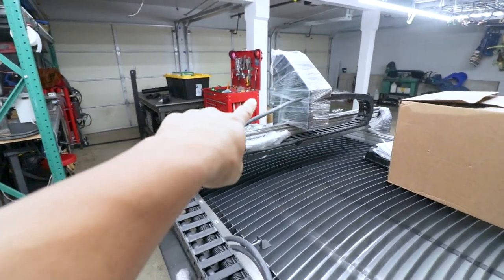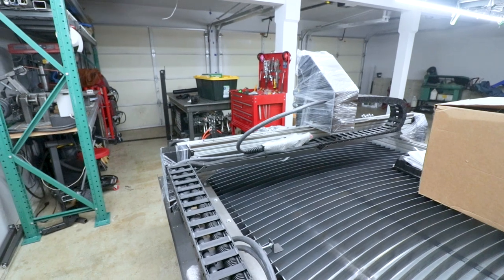I just wanted to show you how that system works, and hopefully it all makes sense and you can see why I plumbed the copper pipe the way I did. I'm using half-inch pipe for all my plumbing here because I'm only running a short distance in this 500 square foot shop. If I was running a larger shop I would go with three-quarter inch, but half inch is more than enough for feeding the CNC plasma table.